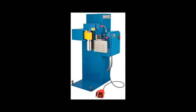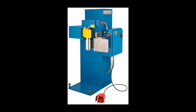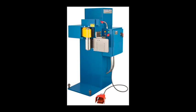The V1006 is different than our other models because the steel and urethane coated rolls are mounted vertically. They are supported only from the top and cantilevered down. This unique design allows the rolled parts to simply drop off the machine at the end of the rolled cycle because there is no drop arm involved.